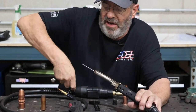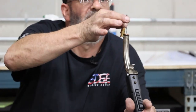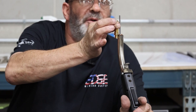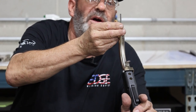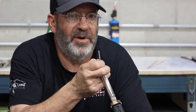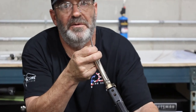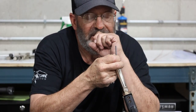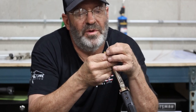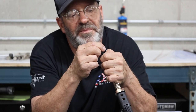And you can clip it off at the right length by putting this up with your threads simulated down the shoulder, and you know that this thing is gonna cut off about right here. And so we cut it off right there. We don't twist this. You can lengthen and shorten your liner by twisting on your gun. So we don't wanna do that. We always want it to be relaxed so that your wire will come through here in a relaxed state. You don't want it rubbing against the liner. That's the worst thing that can happen.